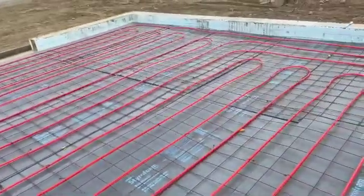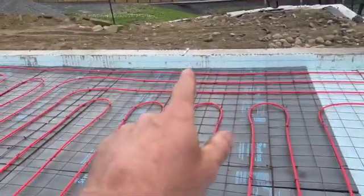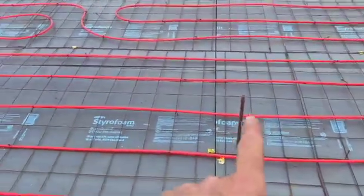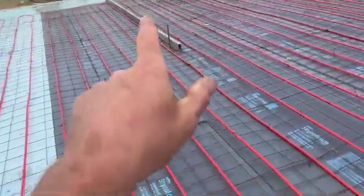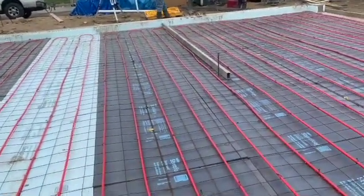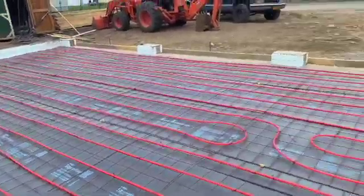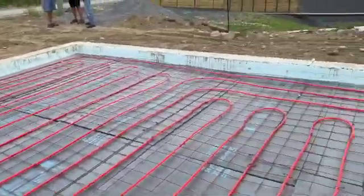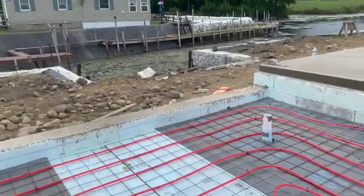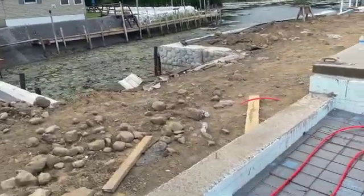This is 48 foot so I got my 16 foot screed. I bumped it over here out to 16, put a little piece of metal there, then put one 16 foot away, and then put a piece of metal on the wall 16 foot out. This is 32 this way so that should work out good. This garage floor has about a two and a half inch pitch from the back to the front so any water will run out of here.